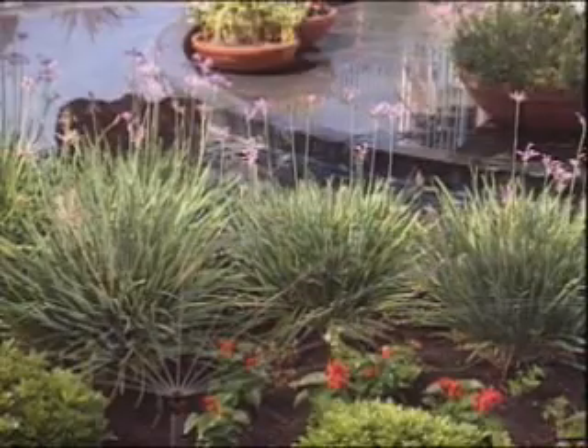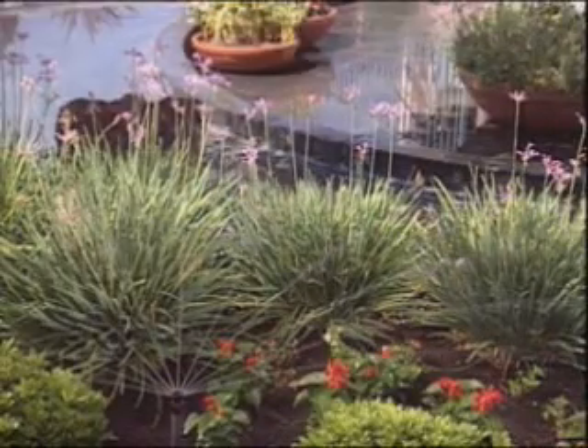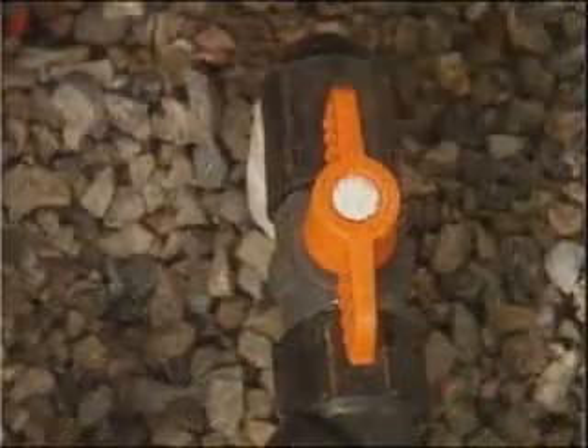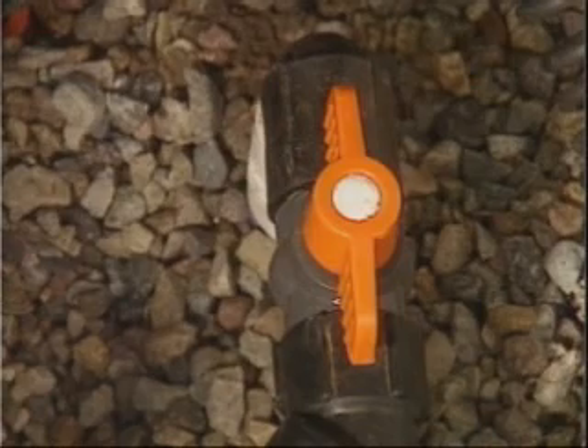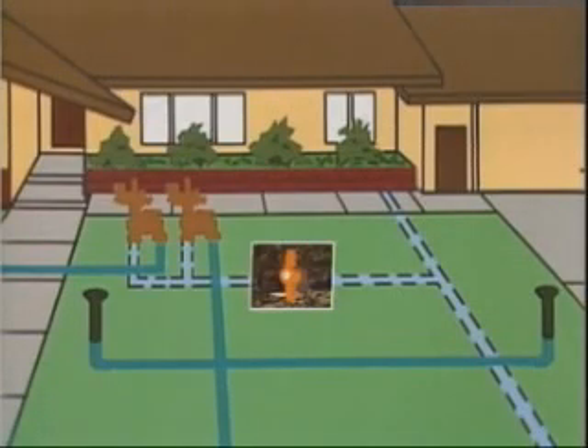In an emergency, you can turn off the sprinklers from any particular valve by turning the valve's flow control stem clockwise until it's hand tight. If you ever need to shut off the water from entering your irrigation system, turn off the shutoff valve located upstream of all your anti-siphon valves. You should always do this before working on any sprinkler pipes or valves that hold water under pressure.